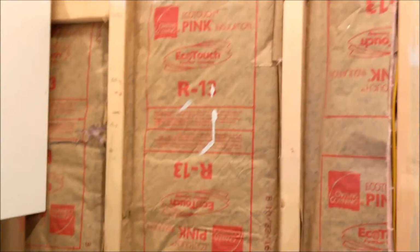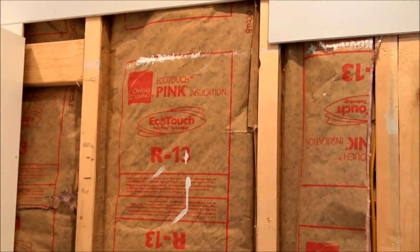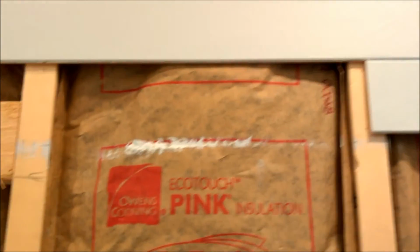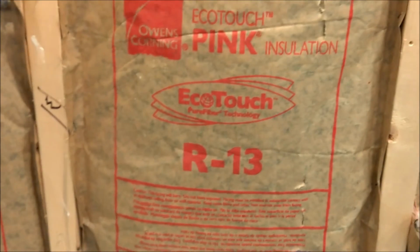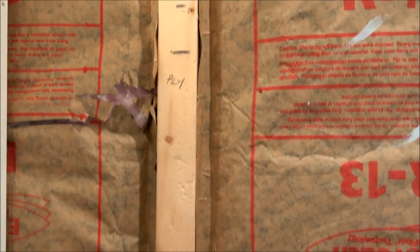And then if you move around here, you remember now, I left this siding off on purpose. I'm going to have some floating shelves that go right in here that come around, kind of just cantilever off the wall. So what I'm going to do is bring the siding down to that shelf, and then from there below, in between two floating shelves, I'm going to have tile backsplash, which I'll show you what that's going to look like. So what I'll do is, you see my note here, siding to that mark, plywood below to accept that tile.